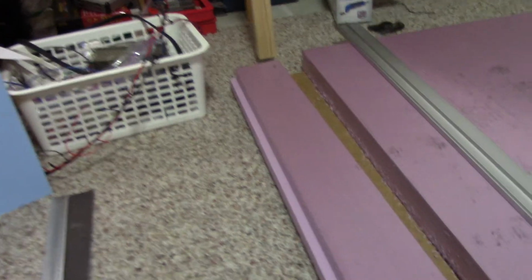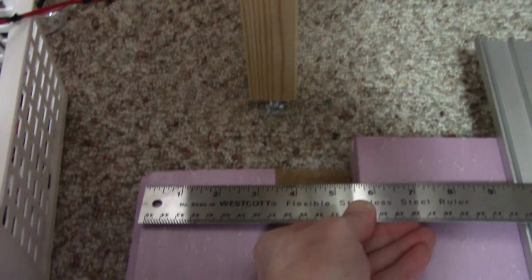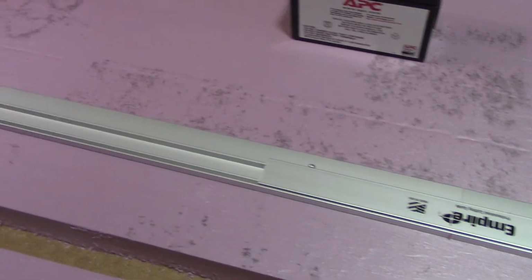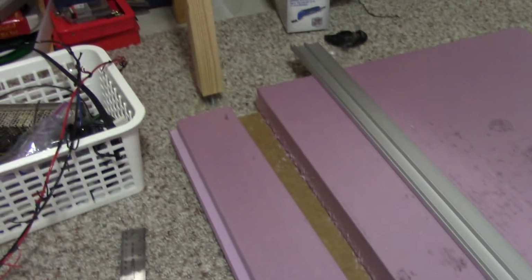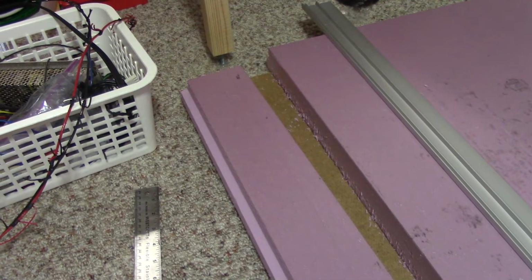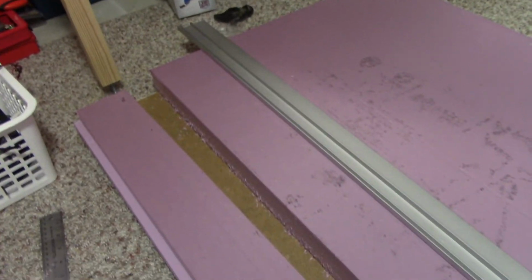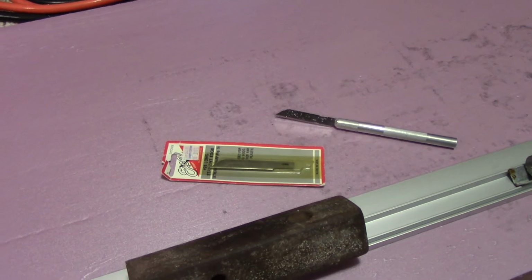and I believe I'm somewhere around just under 3.5 inches at my 8-foot mark. So I'll just make sure that whatever I start on when I measure my next section, once I've got the guide in position, that that is going to be fairly uniform to the height of that section. And then, you just have to measure twice before you start cutting. But before I cut my next section, I will change out that blade to a new one, because it's not worth fighting the blade, because then it wants to start curving on you.